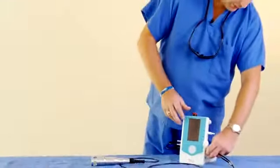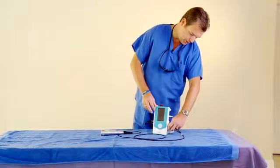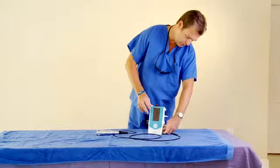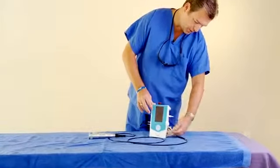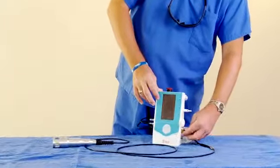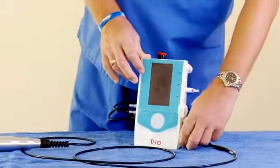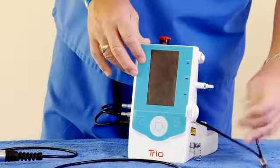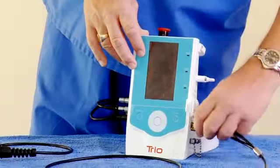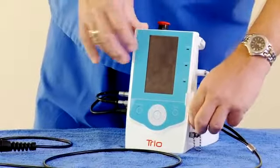On maintenance on the other side, make sure your optic fiber is covered when disassembled. There's a cap for this in the instructions — that'll keep your diode clean and dust free. You can use your cleaning kit on the end a little bit, but definitely keep it covered, clean and dust free. If you don't, the optic fiber will eventually burn out.